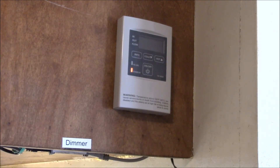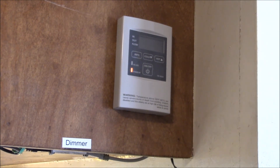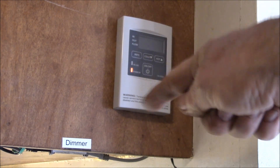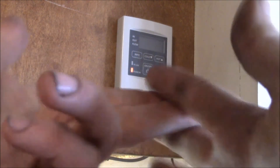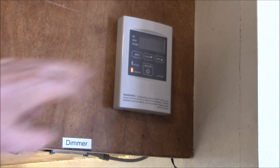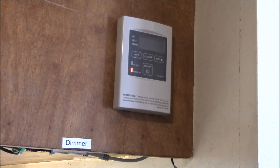The TM-RE-42 couldn't be easier to install — just two wires and they're not polarized. It took me more time to run the wire through the cabinet and into the heater than it did to hook it up. One tip: hook up the remote end first, then connect to the heater. I used two-conductor bell wire and when you cut that you cut both wires at once — if it were already hooked up to the heater you'd be shorting those terminals. Hook up this end first since there's no power here, then hook up the water heater last.